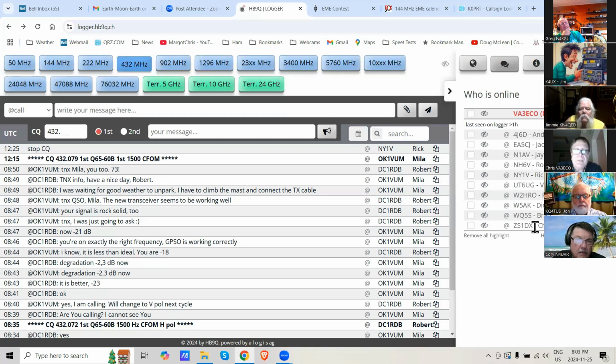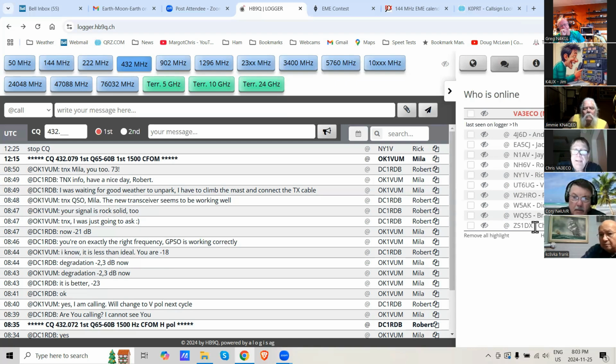Well, a bit more complicated in some ways. They use circular polarity as opposed to horizontal polarity and vertical polarity. But in some ways that makes life easier. Because the frequency is higher, for the same size of antenna you can get a lot more gain. The equipment is, you're looking at transverters quite often, or if you've got an IC-9700, then I guess you just need an amplifier. But a transverter is not a bad way to go, and they're available from a place not far out of Tallahassee, Down East Microwave, for around $700 or $800 US. So not out of the realm of doing it.